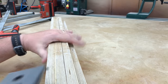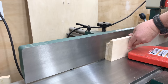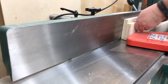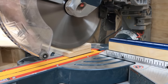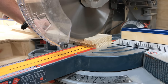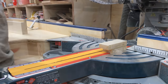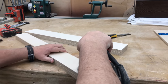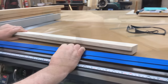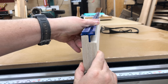After letting these dry overnight I'm going to clean off the bulk of the glue and take them to the jointer for a quick pass, then crosscut them to their exact length. You might have noticed the back fence is stepped down by about three-quarters of an inch in the rear portion — that's so I can fit my Kreg top track on top of it, which will hold the measuring tape for the stop and also a lock-down clamp. It's the exact same top track used for my extreme miter station build. Aluminum cuts pretty easily on the chop saw.